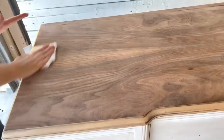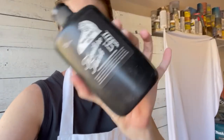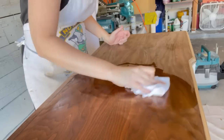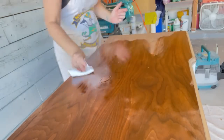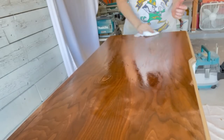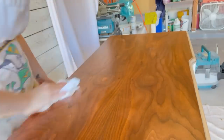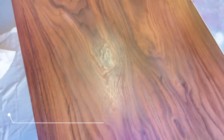Before I apply anything to the top I like to take a tack cloth over it just to get off any remaining dirt and dust. I'll be using Walrus Oil Furniture Finish on top of this buffet to bring out the natural grain. Walrus Oil is applied with a cloth and buffed off after a few hours — I like to let mine sit overnight in most cases. On this buffet I applied two coats for the finish. If you're interested in trying any Walrus Oil products there is a link in the description for 10% off your order.